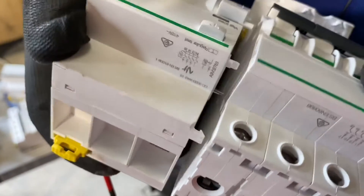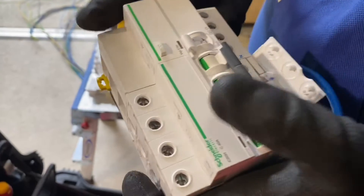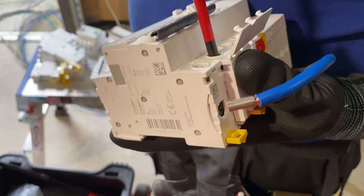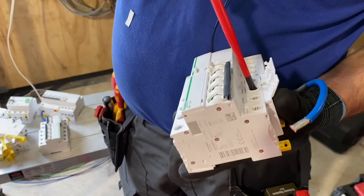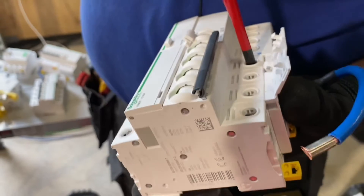See that go into there — and they'll click together. Oh, there we go. And now your screws are going to do up at the bottom here, and obviously interconnect the neutral. Are you going to do those to the required torque setting now, or is it something you do later on? No, I do them later on, Gary. So that at the end of the job, when I'm ready to start commissioning, everything's torqued up at once. That way I know everything's torqued up and I haven't forgotten anything.